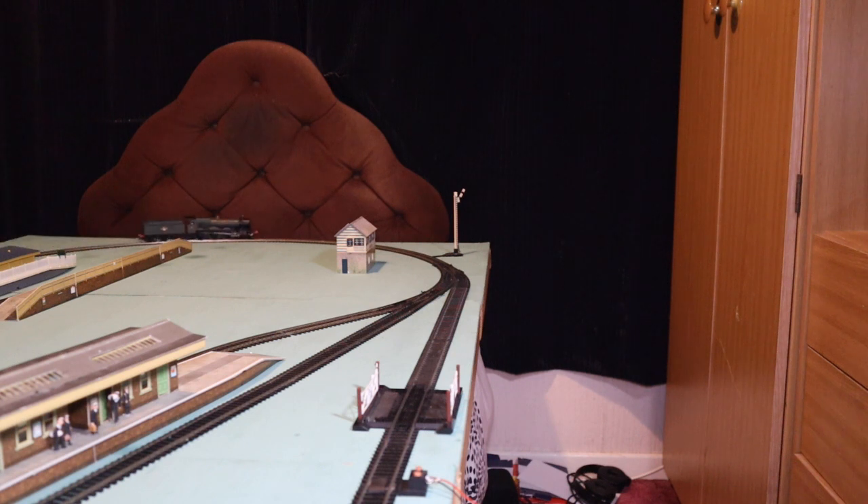As you can see, it's running very very well indeed, and this is part of the running-in process. Once I finish shooting this video, I'll continue the running-in: an hour running forward and an hour running backward at moderate speeds, and only then will I commit this one into service. I'm going to stop the camera briefly and then we'll have a look at this one on the lazy Susan and talk about the model itself in detail.